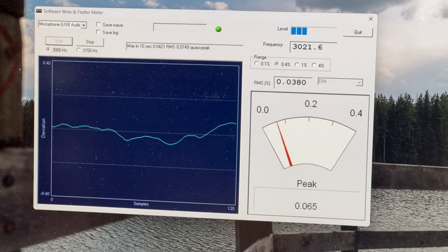But there's a lot of gotchas this deck has. There's a few capacitors that aren't really documented or labeled properly, and two of them are C133 and C233. I'll show you where those are later. The deck does have them, but they're not marked. They're really hard to find, and really hard to figure out what they are, so yeah, I'll show you that in a minute or five, but first,